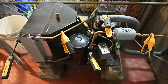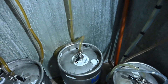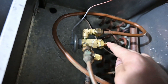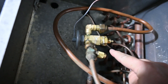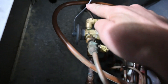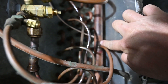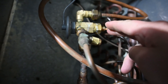All this information is being entered into the app and it's calculating everything for us, making the job a lot easier. Inside we have our thermostatic expansion valve on the indoor unit — this is an adjustable TXV. Because the superheat isn't where I want it yet, we're adjusting it to get it there. This is the power head with the transmission tube, monitoring the actual suction line temperature. We also have the side port coming over to the suction manifold, giving us our suction pressure and converting it to a saturated temperature.